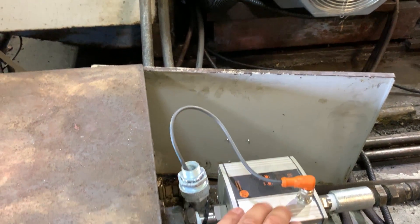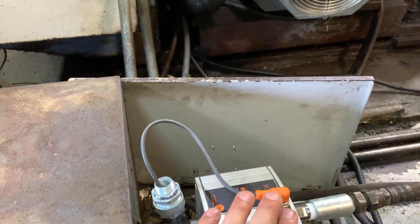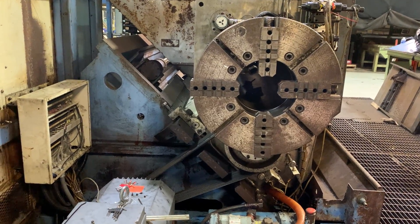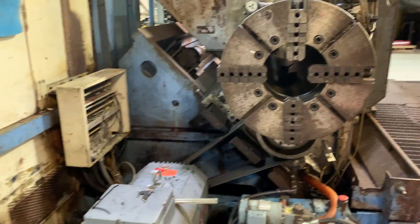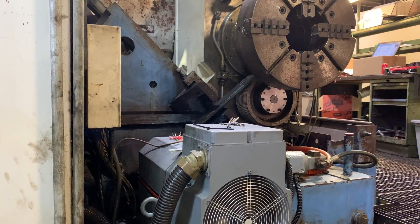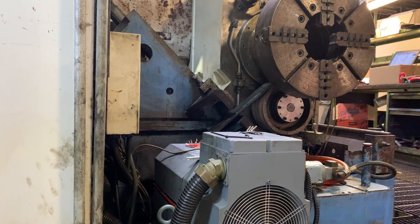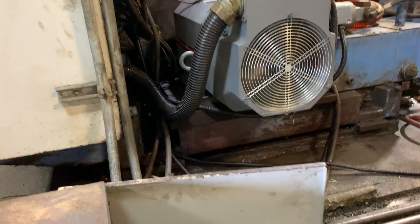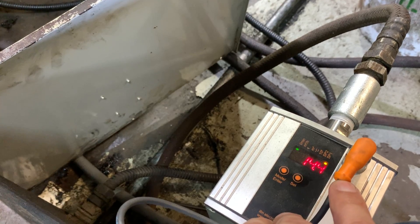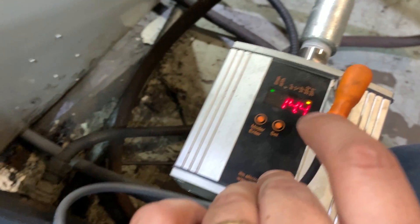On the schematic you will find this flow meter labeled as sp4, but we have to update the schematic because originally there was a pressure switch installed here. To detect flow and control lubrication on any mechanical assembly, the best option is to install a flow meter — not a pressure switch — because if you have a piping clog, using pressure instead of flow means you won't know if oil is actually reaching the mechanical part.